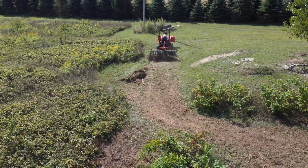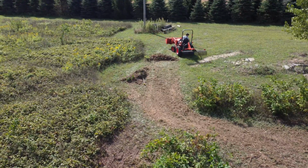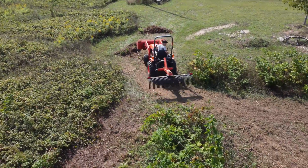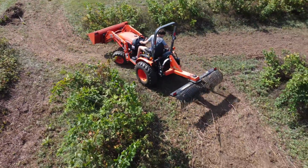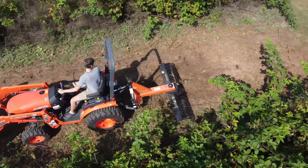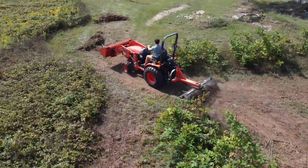Larger tires are going to have quite a few benefits at a small tractor level. Some of them being that the larger tire is going to hold more rim guard, or your choice of liquid ballast. This is something I would recommend to any tractor owner. If the tractor does not already have it, it's an absolute must-have in all situations. I don't see any situations where you really wouldn't want that. So having a larger tire, you're going to be able to get more weight in there on top of the machine already weighing more.